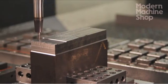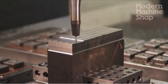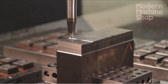Today we're testing a 4mm ball nose in hardened H13 material to determine what's the fastest feed rate and chip load that we can go with that will give us reasonable tool life — not pushing it enough that we're going to break the tool, but not going slow enough that it's not cost efficient.